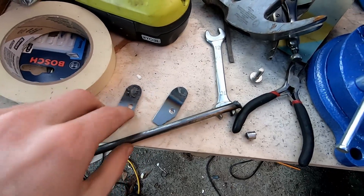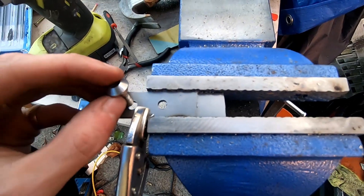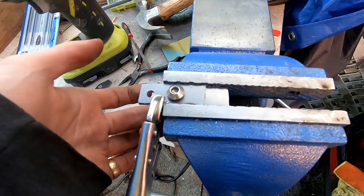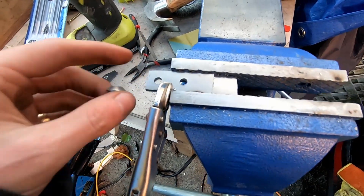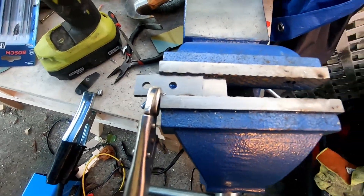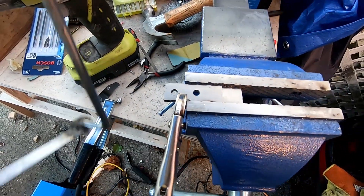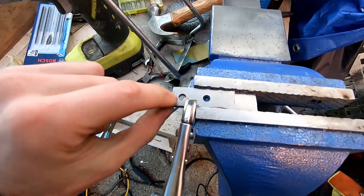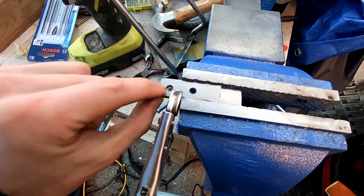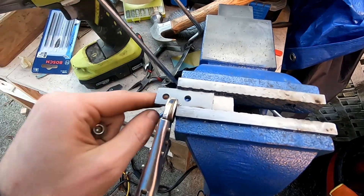What I'm going to do is remake these pieces so that they're centered. This time I've tried something completely different — I've basically drilled two holes the right size for that bolt. I'm going to try and weld this from the top as a tack. I have no idea whether this is going to work; I think it's going to look absolutely horrendous. But I should just be able to sand it completely flat on top, and then support it from underneath, which will help me get the angles just right.